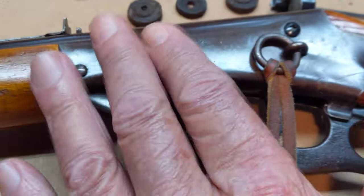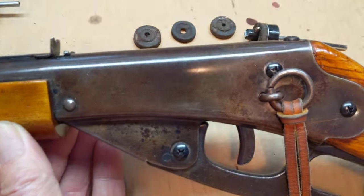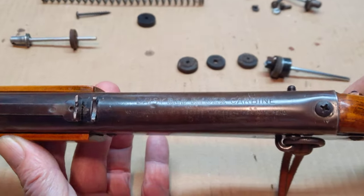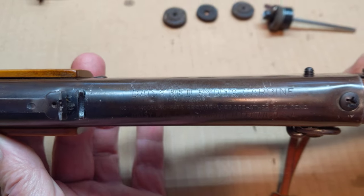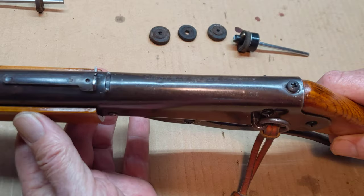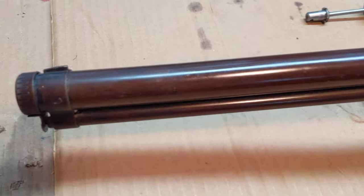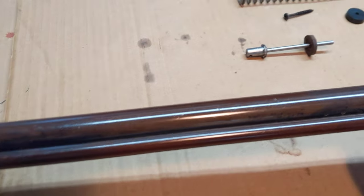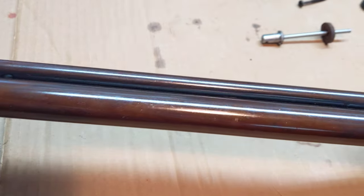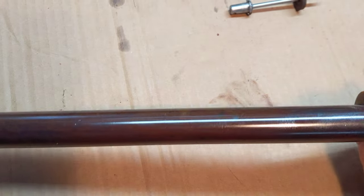Let's take a look at the finish on this gun, because it's got a really good example of patina. It was originally a blued gun, and as we rotate it into the light, you'll notice there's some blotchiness — that's where the original blue has basically been eroded away. We have a roll stamp there: you can see it's a Red Ryder, number 111 model 40, and it's a Plymouth gun. Rolling on down the barrel, you see that kind of rust-brown, purplish, plum-ish looking color — that's all patina. The darker spots are where the original blue is still intact, but time and heavy use have worn most of the original blue away and it's been replaced by a lighter end-grain rust.